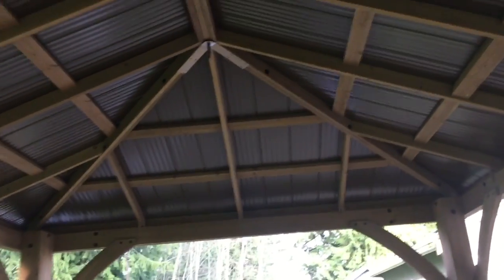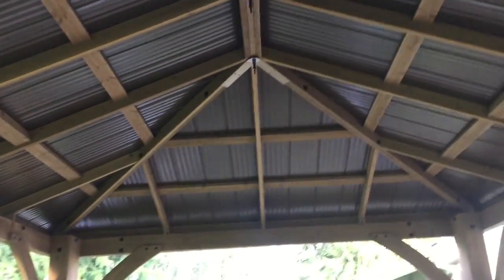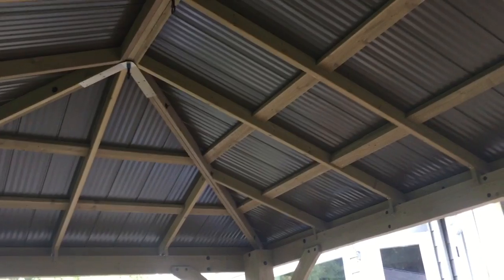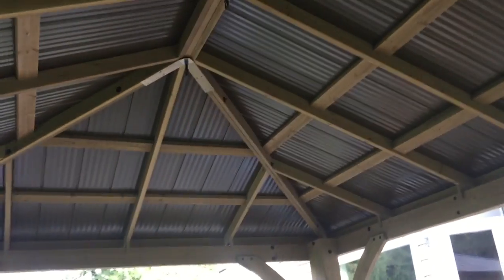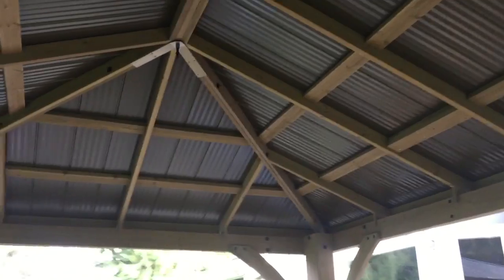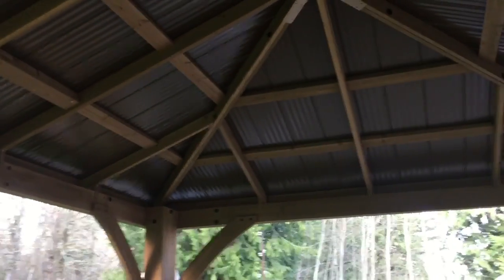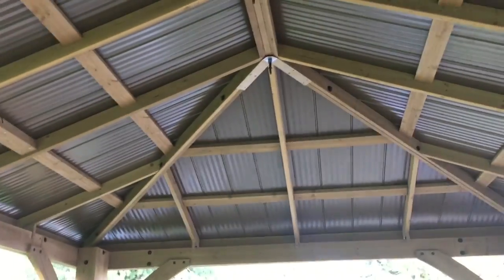I don't think 3 can do it. I think you guys use 3 guys for the first rafter, but you're going to need 4 people for the second and third and really even the fourth, because it just gets tricky as you're trying to hold everything and get it to snug up and that kind of thing. So anyway, 4 people on that. That would be my other piece of advice. And then also the guy that's going to be in the middle, make it a guy that has some strong arms and shoulders, because he's going to be holding for a while.